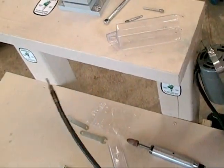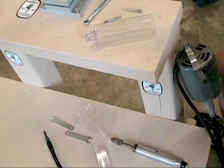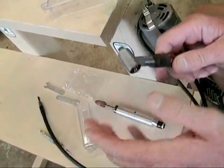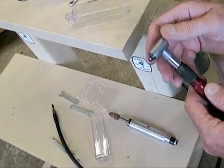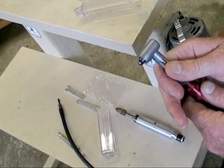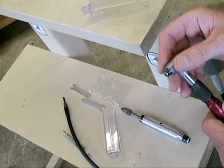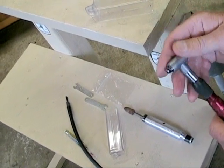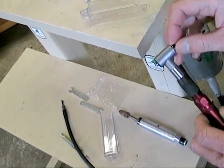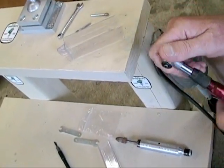As far as when they first start to run this, is it normal for it to have a little more heat? It's going to get some heat. All the gears and everything in here are brand new — it needs to mesh up and get broke in, just like a car. Your head would get a little warm and sometimes it'd get pretty hot. After about the first run or two, you might just run it for 30 or 40 minutes, then kind of let it cool a while.